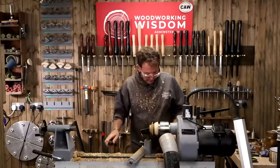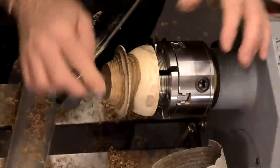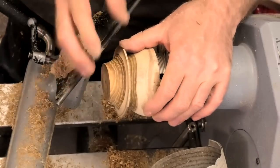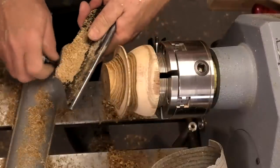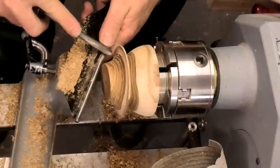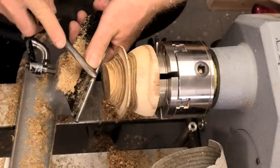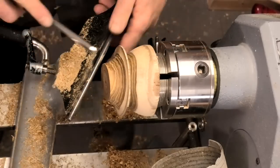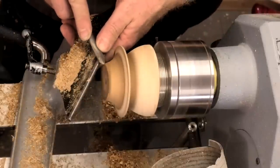Look at how much I'm kind of leaning with my body — there's a lot of body movement, shifting my weight between my two feet. Let's have a look — not too bad. Got a little bit of bark there. This feels at this stage actually a little bit rough — I want to round it. Best thing is abrasive — so much easier. If I try to come in with the chisel now I guarantee we'll chip it. Move things round again, let's get the gouge cutting down the overhang again. We've done one long curve — now we're going to worry about doing the opposite shape coming around.